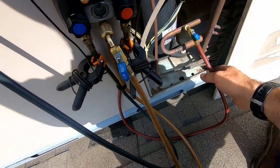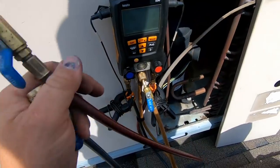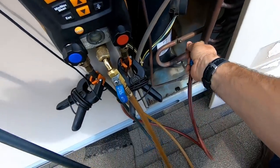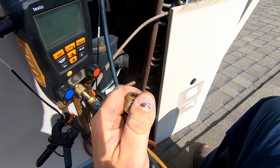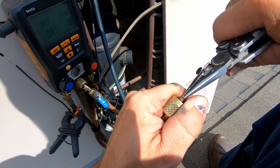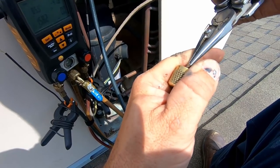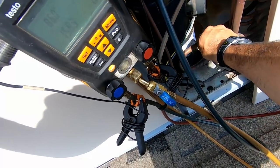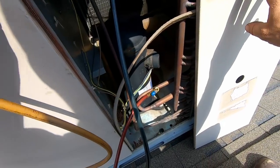I always like to check to see if they've got the O-ring in there. That ain't good. Okay, the depressor is way in there. We can either pull this thing out, or we can back out the Schrader core with the tool. There we go — that worked. Now we've got it. They have a hole there that you could use — not really interested in it right at this given moment.